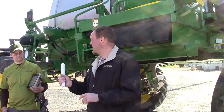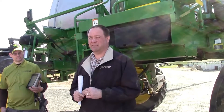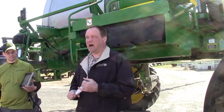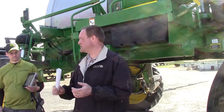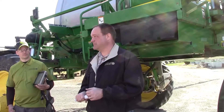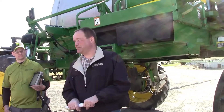On the John Deere, with our flow meter calibrations, when you get them there should be a silver dog tag on the harness for your display, and that has your calibration numbers on there that you need to use. They're normally pretty close to right. If they're not exactly right, before I go change that number a lot, I check your nozzle tips — because the flow meter may be right, it's just the tips are actually putting more out, and that's why your pressures are different than you're expecting.